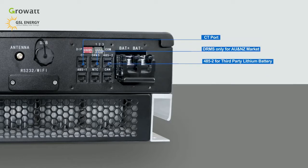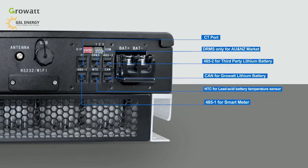The 485-2 port is to connect the third-party lithium battery. The 485-1 port is to communicate with a smart meter. The NTC port is for the lead-acid battery temperature sensor. The CAN port is to communicate with the Growatt lithium battery.